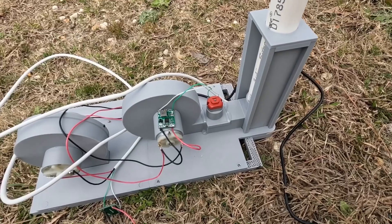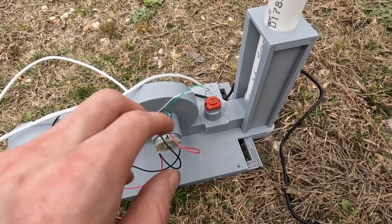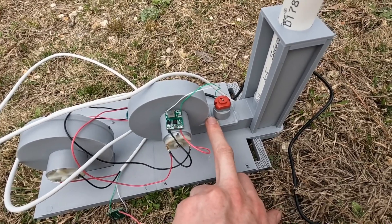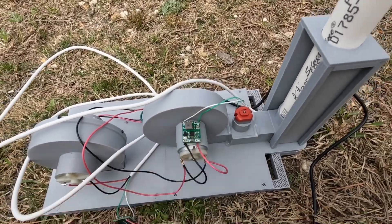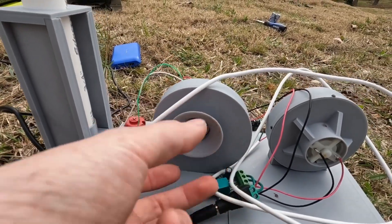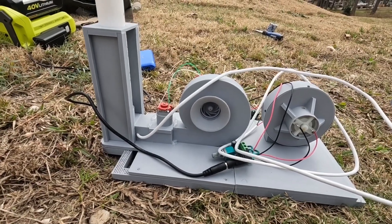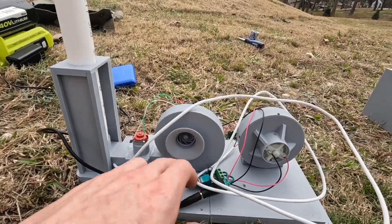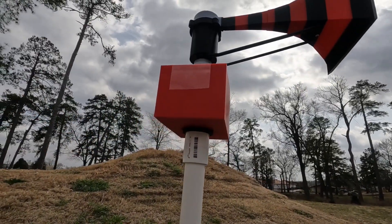Adding those pulses gives it a throatier sound, making it sound like whatever blower you want — a 6M, 5M, 4M, pretty much all the way through the line of blowers that were available. Mine is set really, really slow right now, comparable to a 6M, but that speed can be adjusted from this little potentiometer right here. On the reverse side is the actual impeller for the blower. There will be a screen on the inlet stack to prevent debris from getting sucked up into the blower and fed all the way up into the chopper.